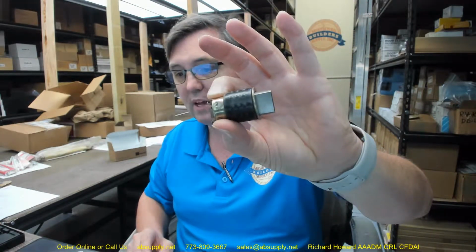Tubular is generally considered less costly than cylindrical, but high-end decorative residential locks are tubular in construction, and they're anything but inexpensive. Nowhere on here are you going to measure 2 3/8. That's because cylindrical locks are defined by the backset from the edge of the door to the center of the hole, like all other locks.